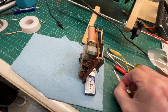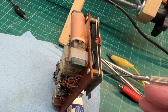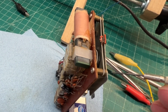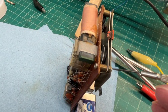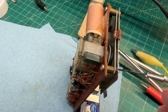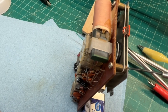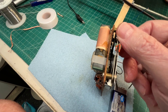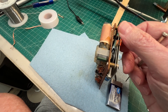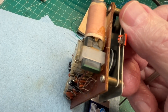I think I figured out what the dial string was hung up on. This screw right here was loose about three or four turns, and I think the dial cord had slipped from the groove location on the shaft back up underneath this area and had seized up. That's my best guess on what was causing that to occur. Let me put this back in the little plastic case.